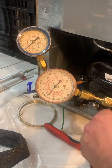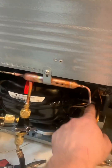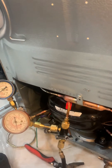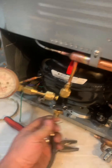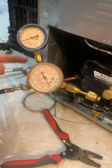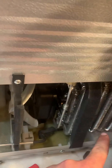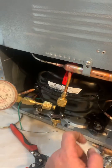Now think about what this means. This means that on our cap tube connection, if we changed the evaporator on the evaporator connections, and the suction connection as well as this connection, none of them can be clogged. Because that doesn't check the discharge, now we're going to disconnect it from here, put it on the low side, purge the little extra air out, and open the low side. Nitrogen is going to push in, go through the compressor, out through the discharge tubing, up through the condenser, through the yoder loop, and back to the filter dryer. Now there are valves in the compressor, but for the most part this should go pretty much straight through.